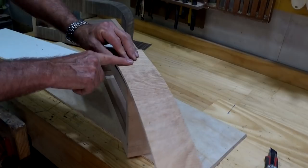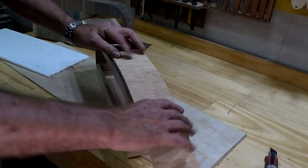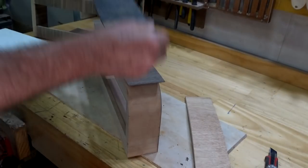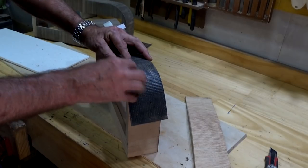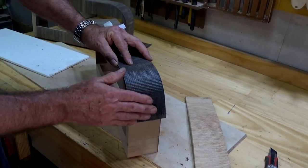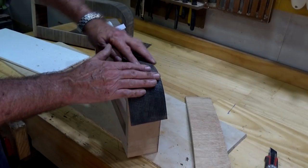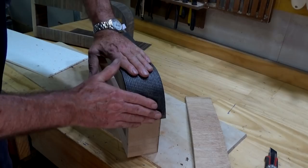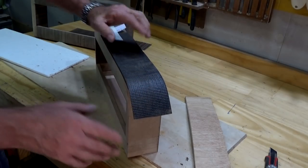I can get a G-clamp on the flat bit and a G-clamp on the flat bit here. I'm still using the strap clamp, but the material that I'm putting between the bending ply and the veneer is this stuff. It's like a resilient thin foam. I think they sell this for tool trays, that sort of thing. And it's good. It's thin enough that it puts ample pressure on the veneer. It's very, very flexible, and it's not too hard to get it all in place.